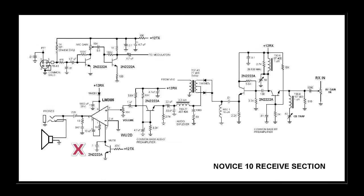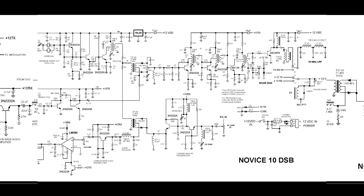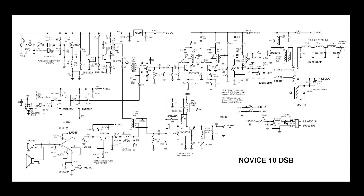Here's an update on the final schematic. Again, a work in progress. As you can see, the Super VXO has evolved some. I'm now getting upwards of 30 kHz of delta frequency, which is a big improvement over the 10 or 12 kHz I had originally. This could probably be improved further by adding a third crystal or by using a real varactor diode in place of the 1N4001. But again, the two crystals and the 1N4001 seem to give me adequate range for what we're doing with this simple transceiver.